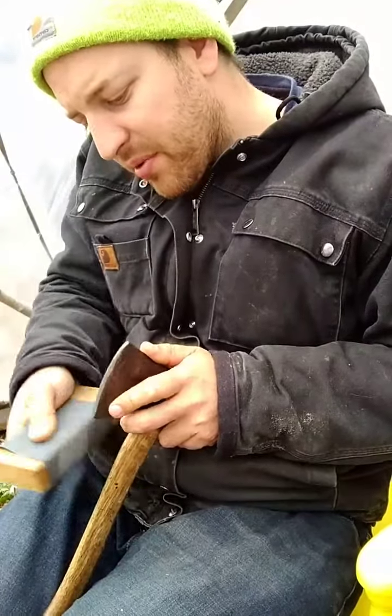It's definitely easy to get an axe that's too heavy, which isn't a problem with the Gransfors Bruks, because a lot of the weight in Gransfors Bruks is back behind the handle, remember, right? So that weight is balanced in terms of how much it fatigues you to hold the axe cocked slightly in your hand. But American style hatchets, they're not really designed for being used choked up really close up on the neck. I've found large versions of American style hatchets tend not to work particularly well for that reason, that they've just got too much weight on the blade side of the handle.